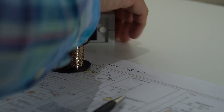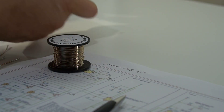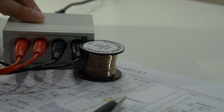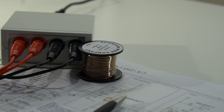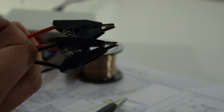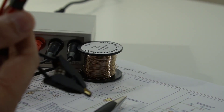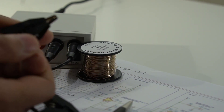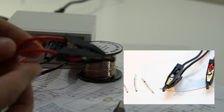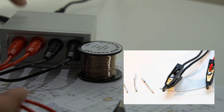The cabling — if I disconnect this — it's a four-wire measurement system and there are Kelvin clips where the two sides of the connector, the top and bottom, are two separate wires going off into the milliohm meter.